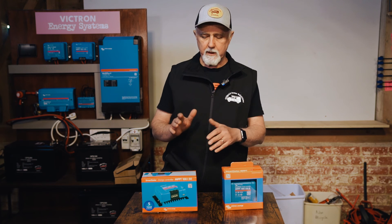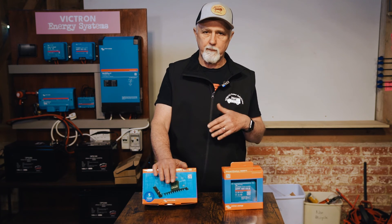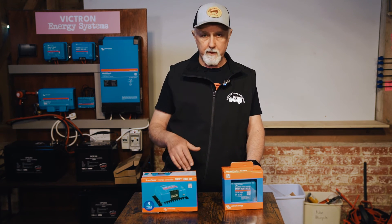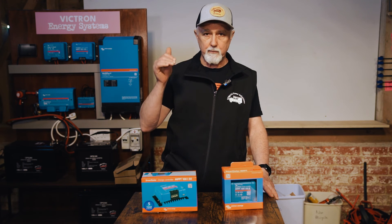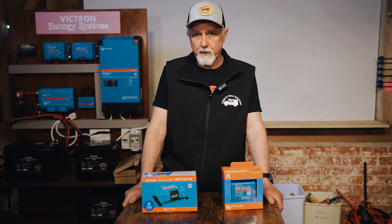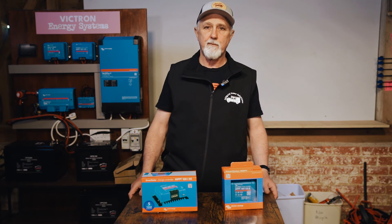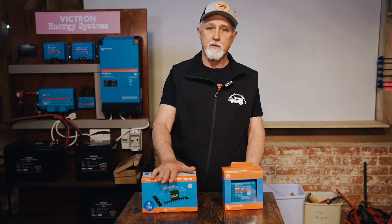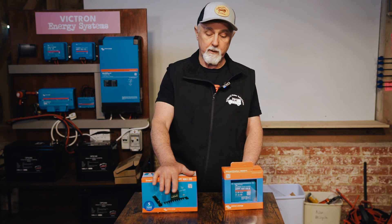Let me talk about calculating the absolute maximum voltage your panels might put out. It is possible to do these calculations and there are examples online, but not everyone wants to go into that level of detail. The easiest approach is simply to build in a margin for error — a 20% buffer above the stated VOC, or 30% if you want to be even more comfortable. Under those conditions you should be absolutely fine and not fry anything, even under exceptional circumstances.